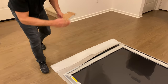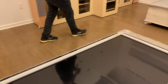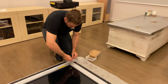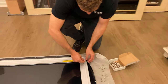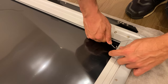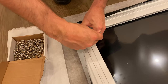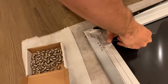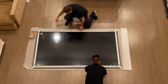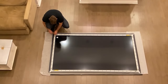I'm going to move to the exact opposite corner and do the same thing — attach the spring to the screen material, then attach it to the inner side of the frame using the tool. This is to make sure that the screen remains centered to the frame. Continue the process by going to one corner and then the next one, attaching one spring at a time to keep the tension on the screen.